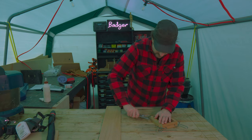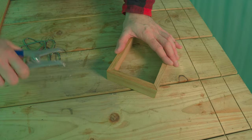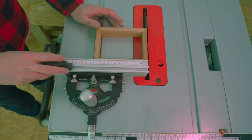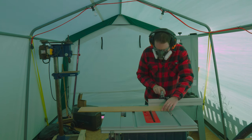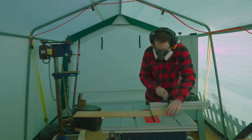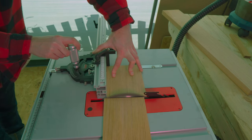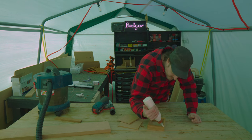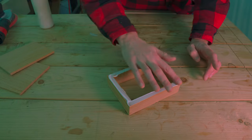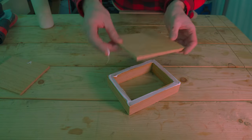I gave this all a couple of hours to dry, now I can get the clamps removed. I need to cut this panel for the top and the bottom, so I'm going to use the box to set up the stop on the mitre gauge, then I can get a couple of bits cut. Now I can get the top and bottom glued on — I'm just going to run a bead around, get it spread out, and then they can go into place and get clamped on.